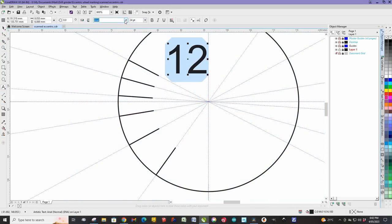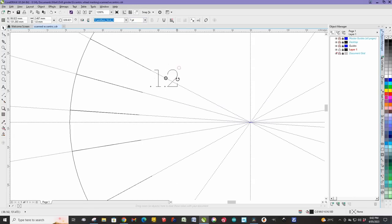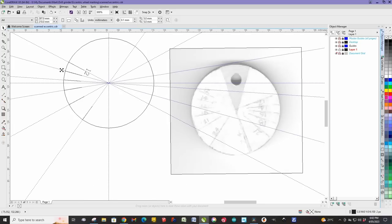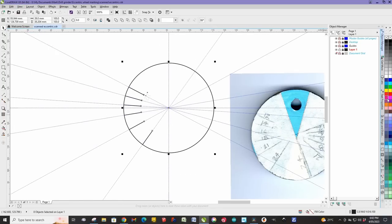And I figured that there's got to be a way of doing it from the CAD program that I already had. So what I'm going to do is to have a go at actually putting the lines on directly on the CAD part in Autodesk Inventor. And then we'll try and create a PDF file of that, import that back into CorelDRAW, and turn it into something that we can export to my CNC milling machine.